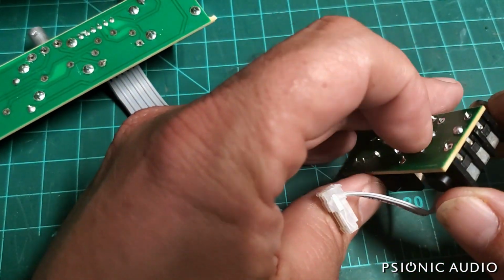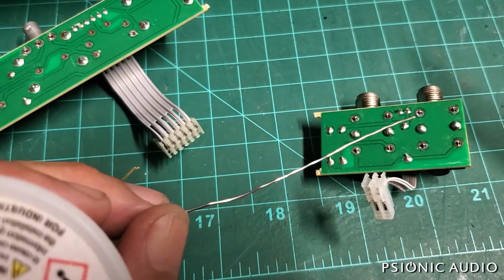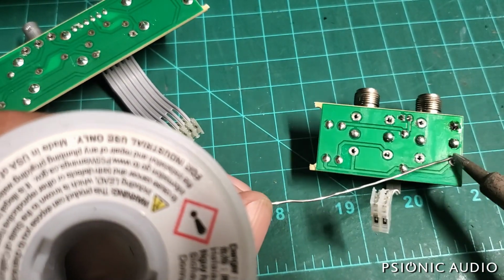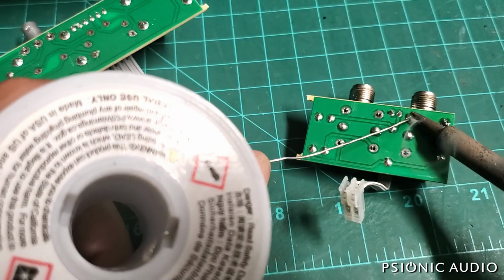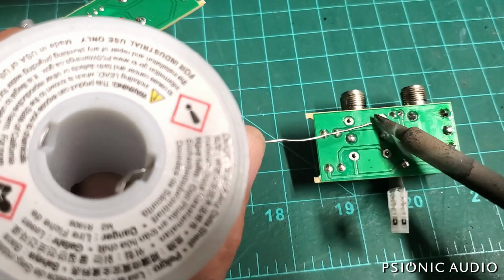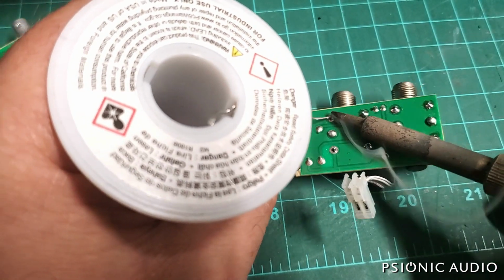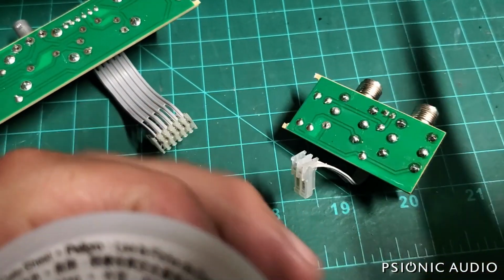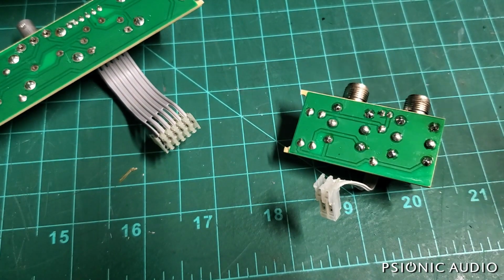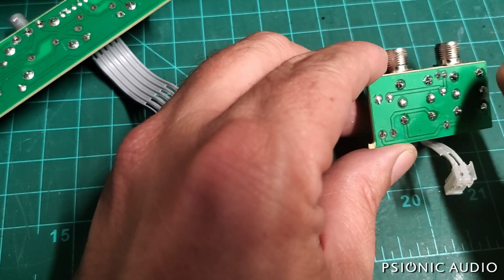I can't really bend these over. Some input jacks, the little prongs are long enough that I can. But I happen to know that the solder that I use is higher quality than the wave soldering they do at the factory. I'm working hot and fast so as not to lift anything on these pads. These are stereo jacks being used in a mono application. So I'm not too stressed about the ring connections. They can stay factory. It's the tip and sleeve that matter here.